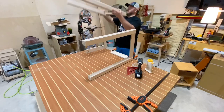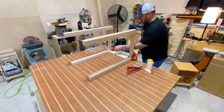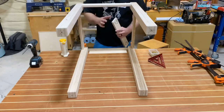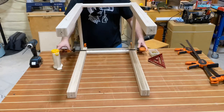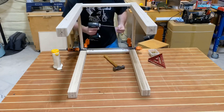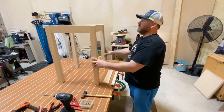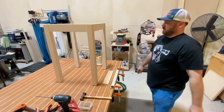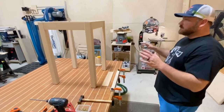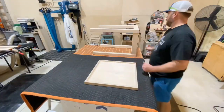As you see, the pocket holes are pretty strong — those legs are just cantilevered all the way out and they're not budging whatsoever. I bring in a few extra clamps to keep everything snug and it's coming together nicely. I'm installing the last apron, making sure everything is nice and tight, and we're going to raise this thing up and see how we did. It worked — pretty cool.